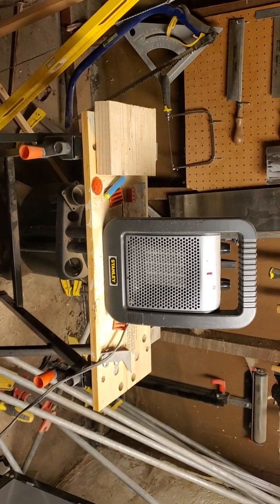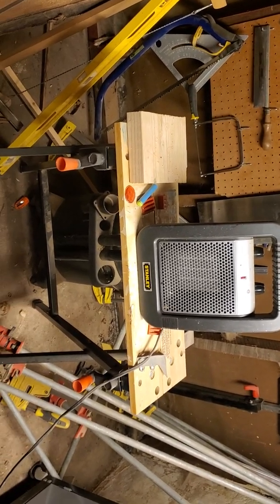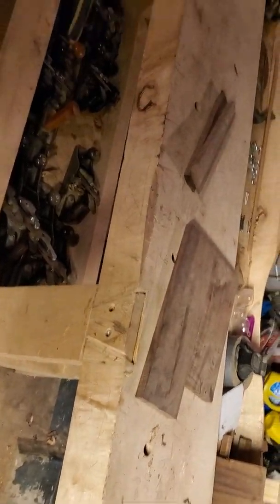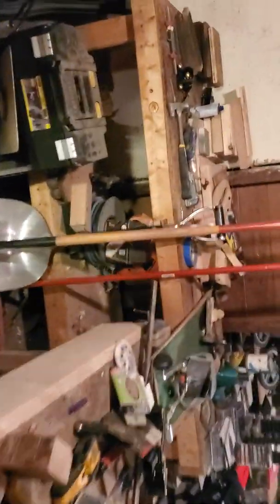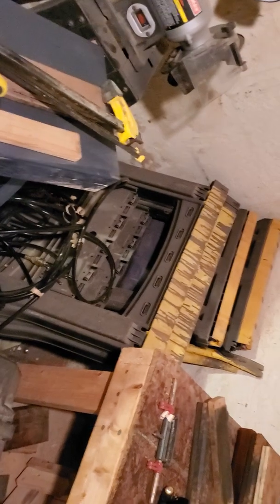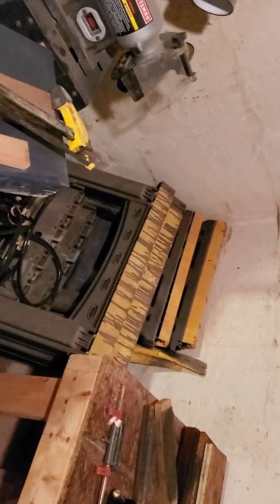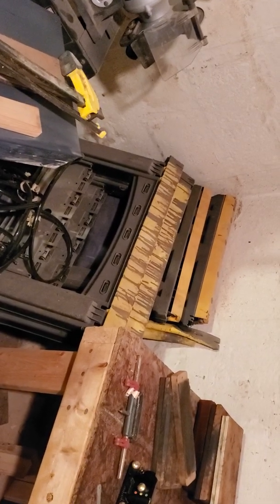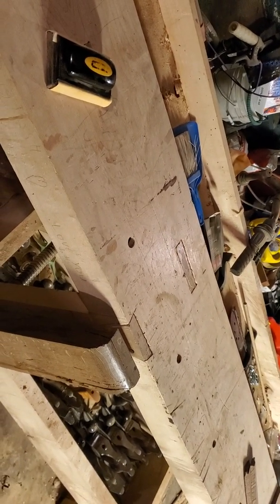Some workstations are flat plastic surfaces with a lot of holes and some clamps and holding tools. They range from fairly cheap to really expensive. You can buy a pre-made bench, a bench kit where you just assemble it, or you could do what I did — my first one was a sheet of plywood on top of two sawhorses. If you wanted to get really into it, you could glue up a bunch of two-by-threes to make a benchtop and set that on two-by-fours.